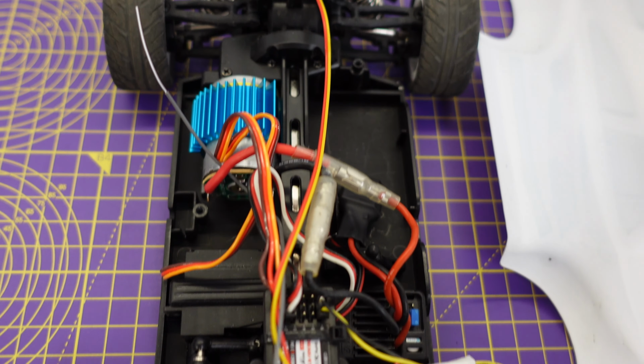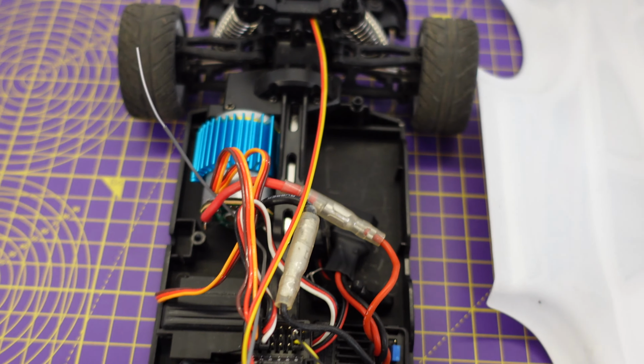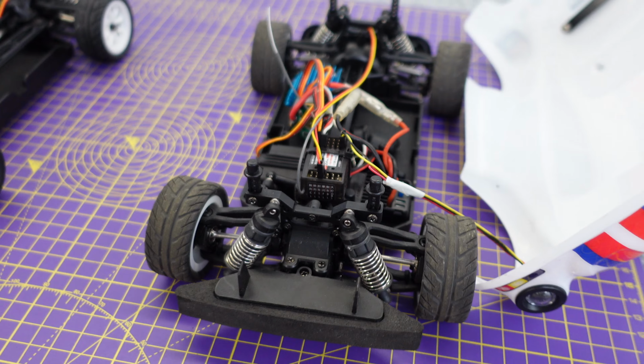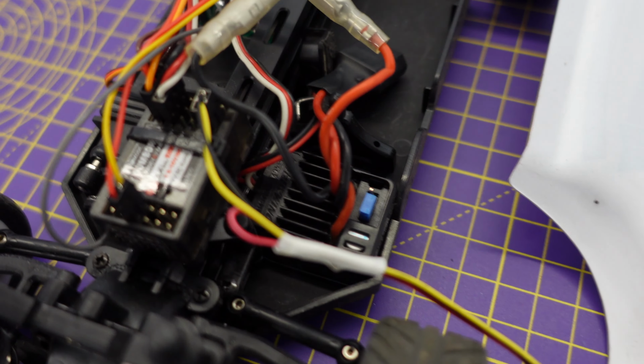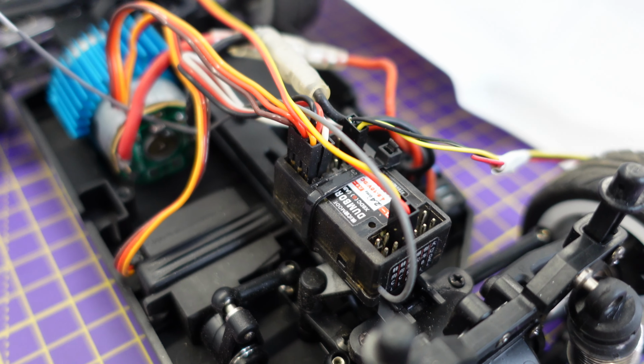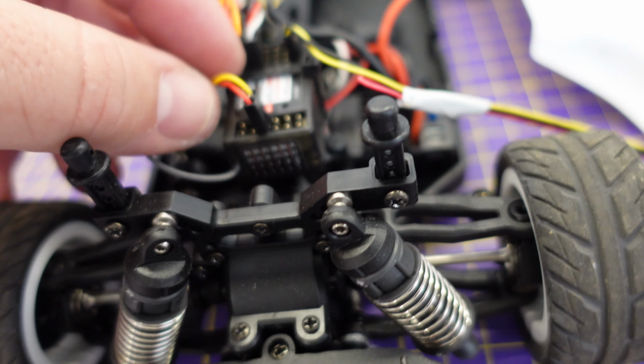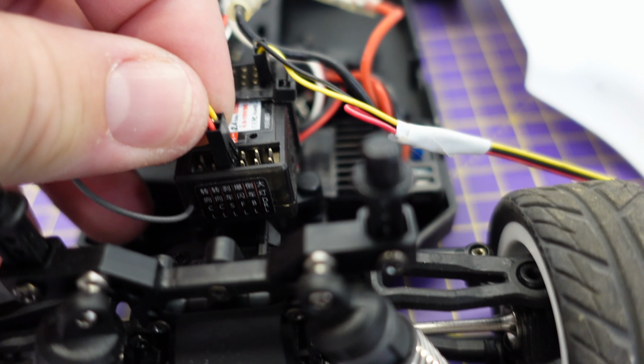And then here's mine that I prepared earlier. Cable management, if you knew what my day job was. Anyway, we got a little Hobbywing ESC in there. I'm gonna leave links to all the bits I've used in the description, but we've got a little Hobbywing ESC in there. That will run 2S and 3S. We got a Dumbo RC receiver there that's also got channels for the lights. You wanna keep the lights on these, then you need to make yourself some connectors up.